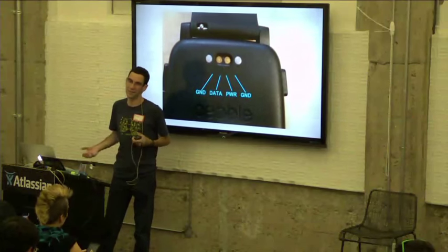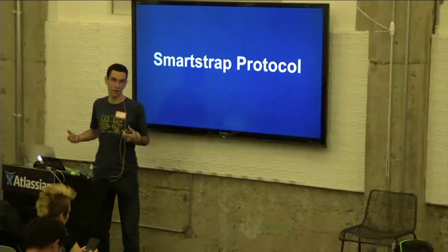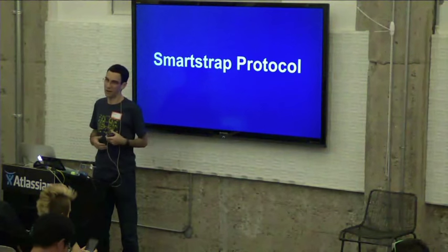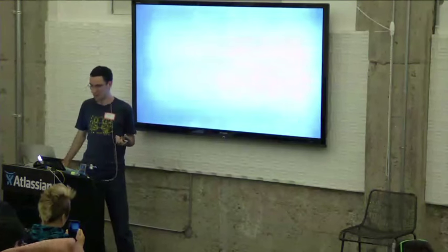So how do we facilitate bi-directional communication over that single data pin? We developed our own custom protocol called the Smartstrap protocol, which defines what the bits actually look like over that data pin and how the watch and the Smartstrap talk to each other. So like any good protocol,